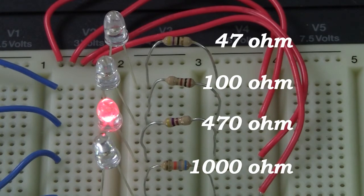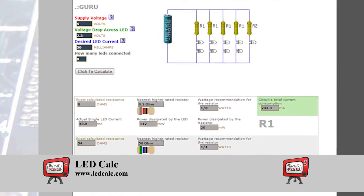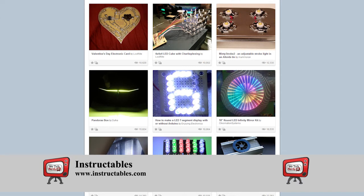As you can see, the circuit works in varying degrees with all four resistors, although the 1 kilohm version just barely glows at all. But it does work. LEDs will function with a wide range of voltage and current. You don't want to put in too much, but it's always safer to put in just a little bit less — you will get a slightly less bright result. I enjoy tinkering with LEDs, and if you do too, you should check out ledcalc.com. This website can help you figure out what resistors you need for your LED circuits — it does all the math for you, and it even draws a picture of the circuit. There are also good resources available on instructables.com, including lots of LED projects that you can do yourself. Some of them are actually very elaborate.